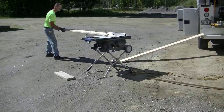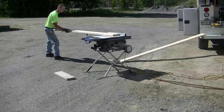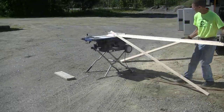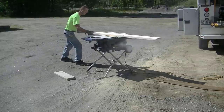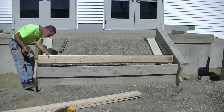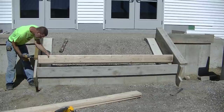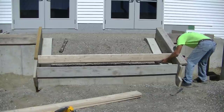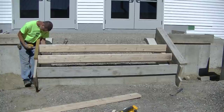I'm cutting a 45-degree angle on my risers so when we go to pour the concrete it makes pouring a little bit easier. The video that shows us pouring the concrete will be at the end of this video, so you can click on it to see how we poured the concrete. The finishing part — where we broom it, edge it, strip the forms, rub out the faces with a sponge — how we finish concrete stairs will be in my Concrete Underground training academy, linked in the description. If you want the more in-depth step-by-step tutorial on how we form, pour, and finish concrete stairs, that'll be inside Concrete Underground.